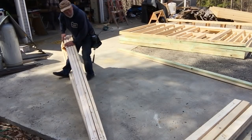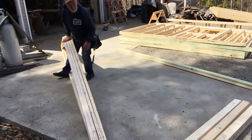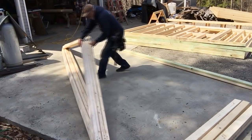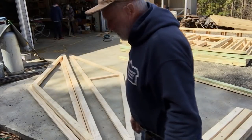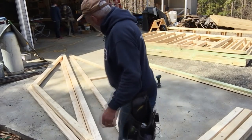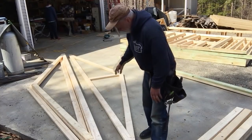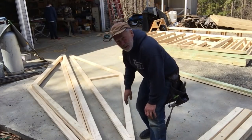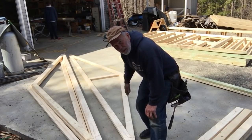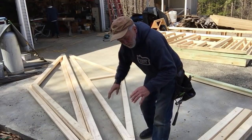You can see it's twisted right here — this one is twisted up. We'll straighten that out. You can see we have one upright in the center. This is our template truss; we're going to make all of them match that. The bottom is straight, the top cords are straight, and we have one upright in the center. That will be plenty strong for what we're doing for this little mudroom.